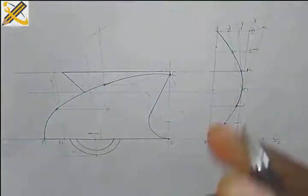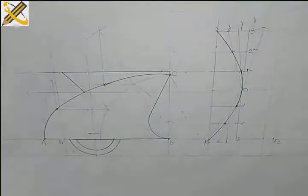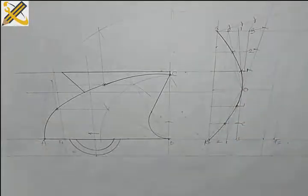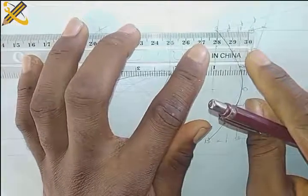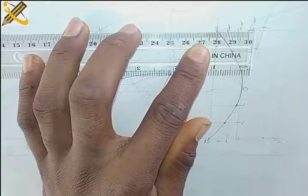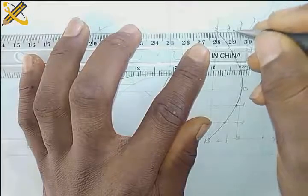Okay, so having developed the parabola, if you take a look at the question, you see a point R towards the right hand side of point H, inclined at an angle of about 60 degrees. But before that, I need to divide this plane into two equal halves here. This length 20 here into half, and that's it here. So this into two, this it here.